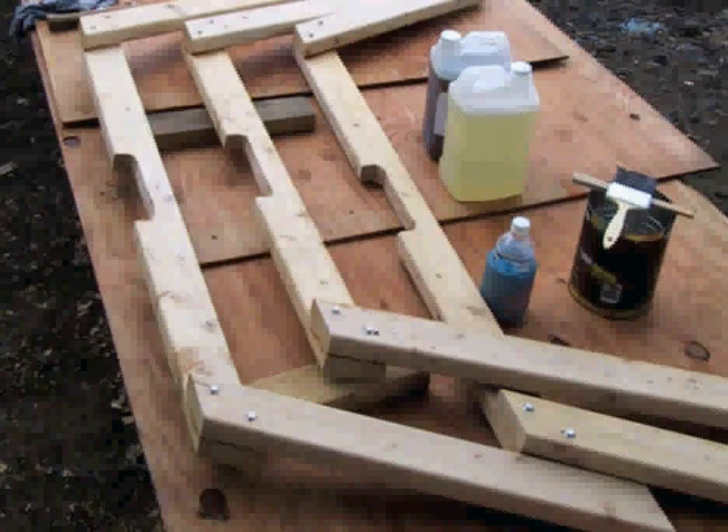Okay, let's get into what it takes to build a boat. The boats that I design are very simple to build. You begin by building the ribs, and you can see these are made of plain old construction-grade lumber — nothing fancy. These are straight two-by-fours for this boat.